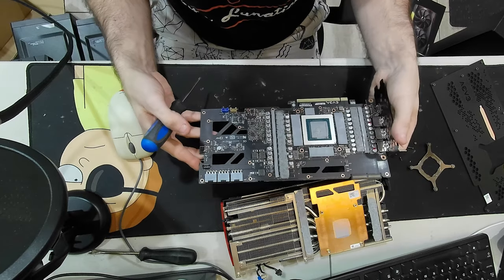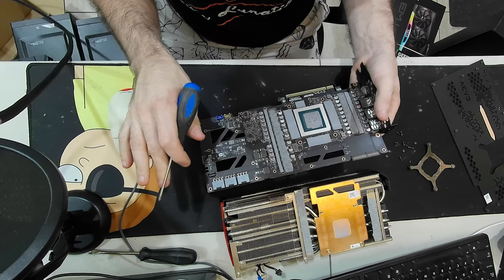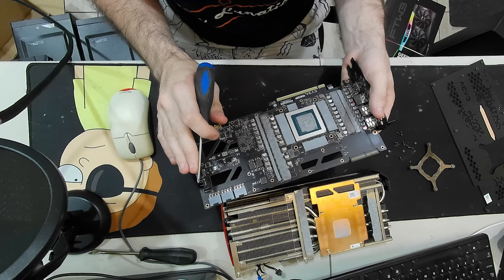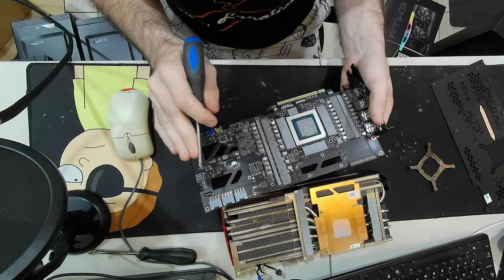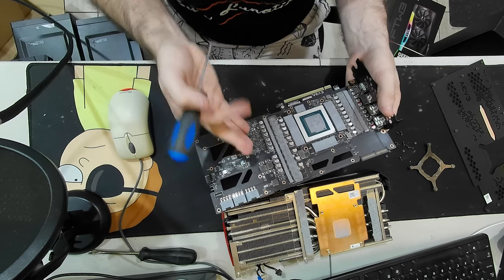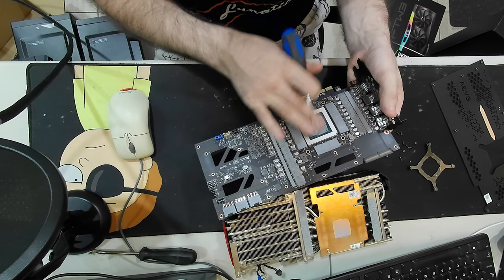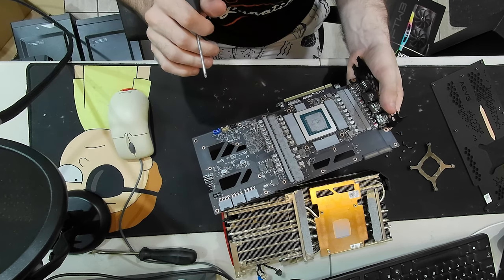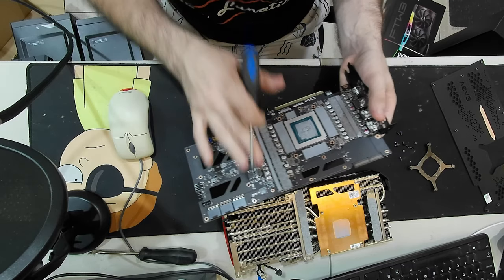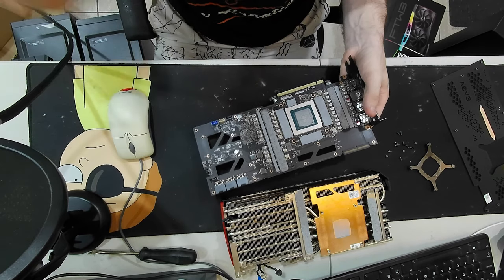I'm not going to shunt mod it today. This is my wife's card, so I'm going to leave it and do an undervolt on it for now until the water blocks come out. Then I'll do a shunt mod when I get a water block for it, because this thing is already running at 60°C at 100% fan speed. I'm gonna clean this all up, get the foam off, and then we're gonna do a Kryonaut application. Also, there are a hell of a lot more phases on this PCB than there were on the XC3.